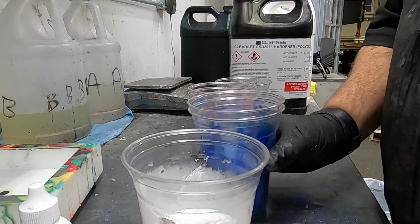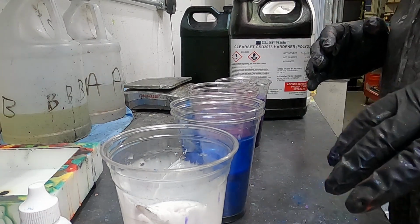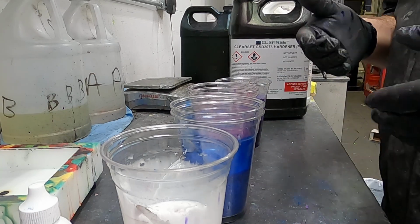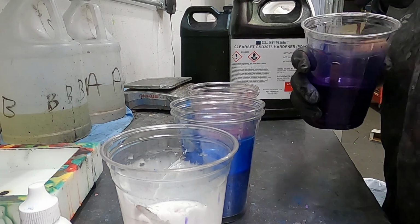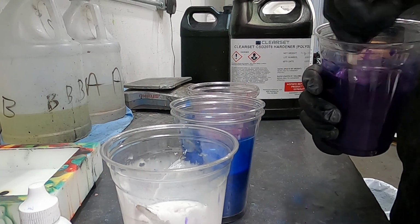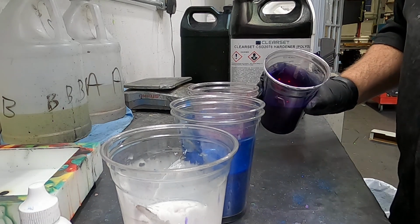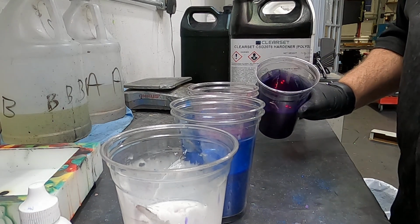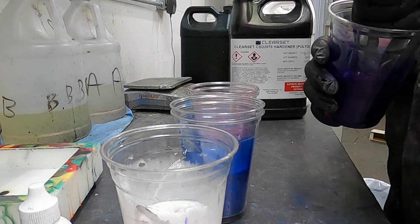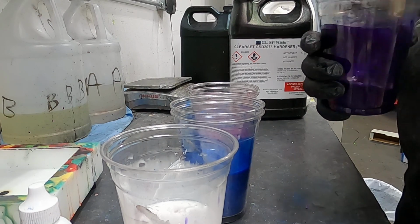Yeah, so these are staying the same. Some resins you'll get different temps depending on what you've put in it. Some pigments can cause it to heat or cure faster if they react. The ones we're using today, whether it's the pigment from Braxton, the Alumilite dyes, or the Smooth On, they're all within 0.2 of each other. So they're all curing at the same rate, which is good if you like to use a mix like we do.